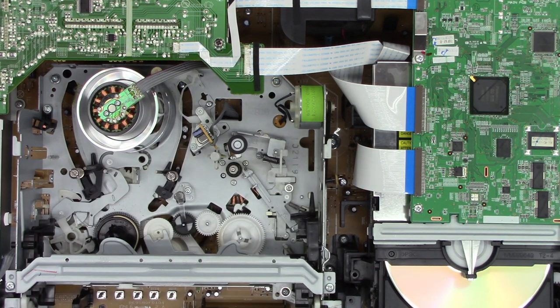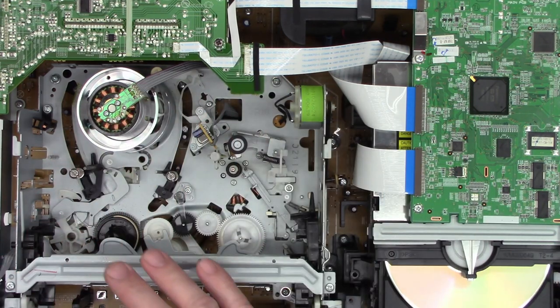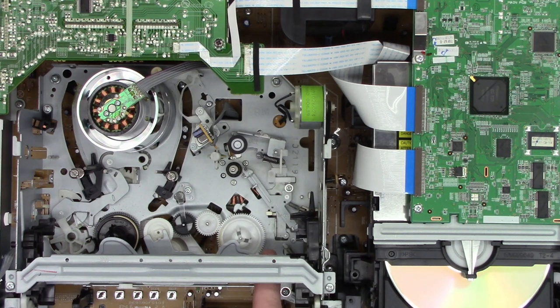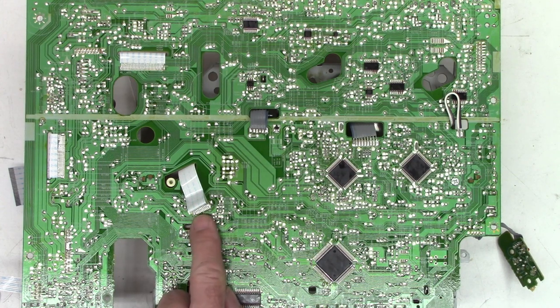Let's get the tape out. Next, we have to tear this thing all the way apart because I have to get the circuit board and the mechanism completely out of the chassis. Then I have to loosen the mechanism so I can lift it up enough to gain access to the mode select switch. A YouTube follower commented that it is indeed possible to clean the mode select switch without having to unsolder the ribbon cable — and yes, it is.